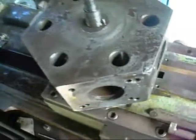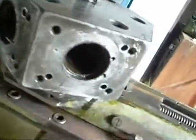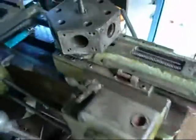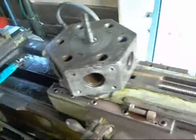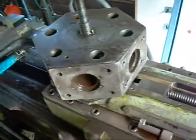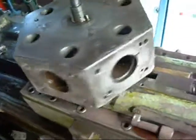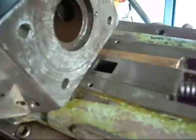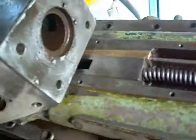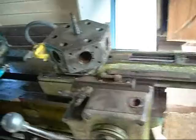I've got the turret back on. I used the stone to clean up all the surfaces — you'll still see the dents but at least it's flat now, particularly around the tool mounting bosses. I'll have to hone inside there though; still a bit more work to do. Let's try the mechanism out — beautiful. It's working quite well now, good as new.